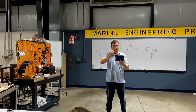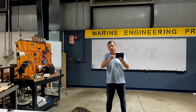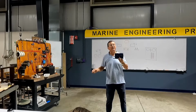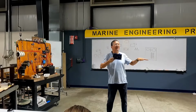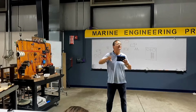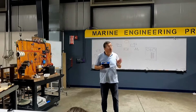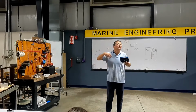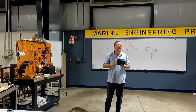What happens with the ACR in this moment? Because this one is fully charged right now. It's going to equalize. This element does not send more charge to this battery bank, only to this one, until both of them are equal. In that moment, it stops. Receive power, but not send out. Dissipate. Nice, no? For that reason, it's normal that if you are running the engines for a couple of hours and you touch this, it's not hot, but it's warm.